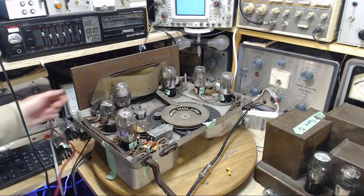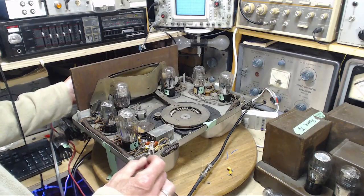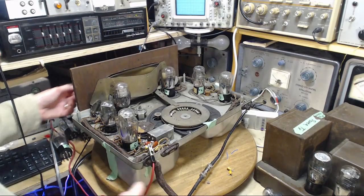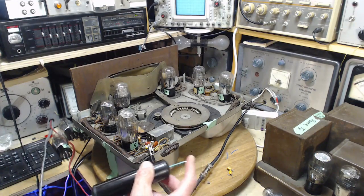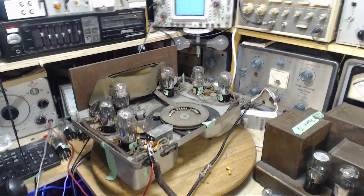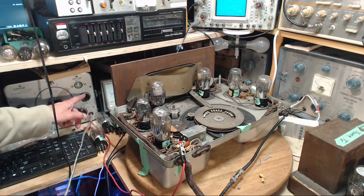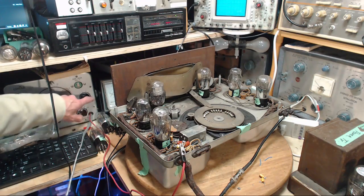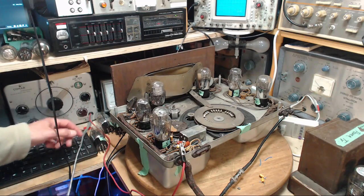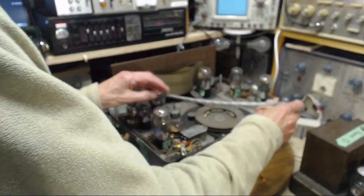Now, turn this down again. Signal tracer on RF. Just tip it a little bit here. You can see what I'm doing with it. Volume. Attenuator. The attenuator works in the very front end of the radio, and the volume works in the rear end. Okay, we're going to listen to the antenna. Should hear a station. I think this is exactly how I left it.